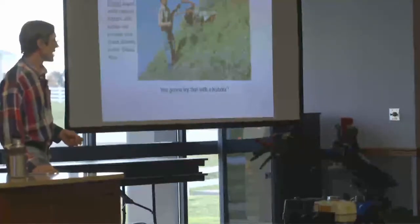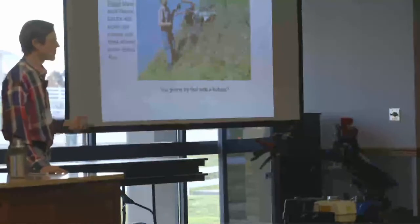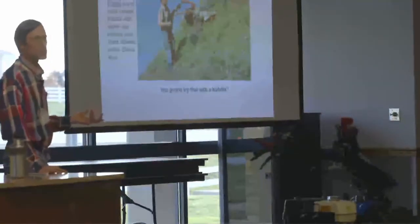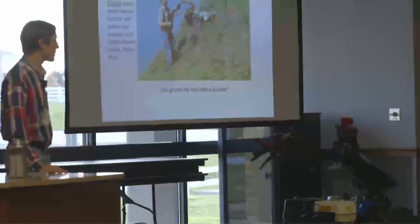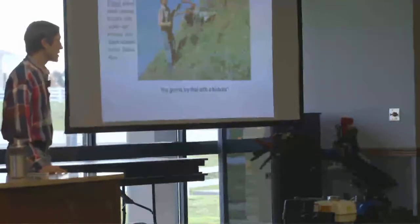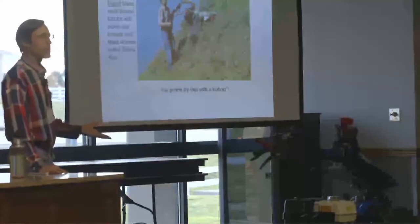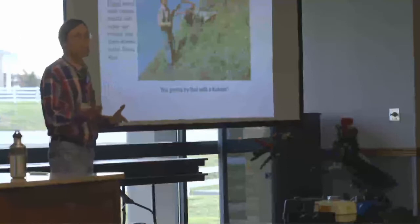So for strenuous activities, for example pulling a plow or pushing a dozer blade, the hydro would not be your choice because you're asking a lot of the wheels at that point. So the gear drive would be much more efficient. To me, the jury's still out on whether the Hydra is worth fooling with. It raises the price of the tractor like $1,500. And if you're doing a lot of mowing, it might be worth it.